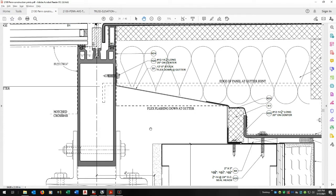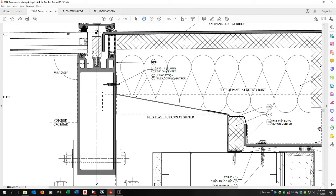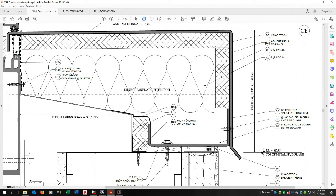I think it'll work — let me know if it doesn't, we'll need to talk about it. When it's on, take the flashing tape that we sent and tape it up and over the filler bar. We're getting kind of a rain screening with how we're building this, but we thought we'd give that a try. When the flashing is here and then later when you put this track in, we want to do flashing tape over that as well, so that's going to make this all just one big airtight pocket to back everything up. You're probably going to need the panels to set this in the right place so you can just drop it in later.